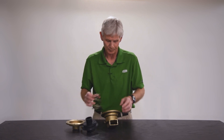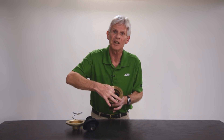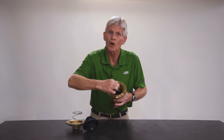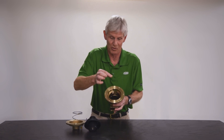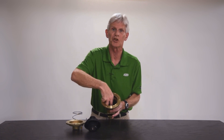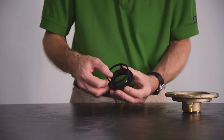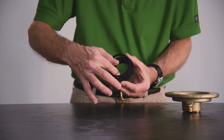With respect to the body itself, when you buy a standard rubber repair kit the seats are not present, because most of the time you never need the seat. We still have the original factory installed seat inside the relief valve body. Take your fingernail and go around the seat profile — that's the sharp part that's going to bite into the rubber seal ring of the diaphragm assembly. If you feel any dings or divots in that seat and they're very light, you can usually take emery cloth and sharpen that seat up a little bit so it bites back into the rubber and seals effectively. But if there are chips out of that seat profile — deep dings, divots, or a hunk knocked out — you're going to have to replace that seat. The seat just pops into place and that's a separate repair kit.